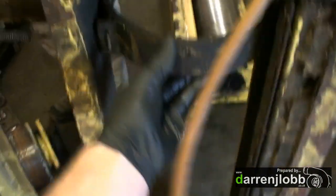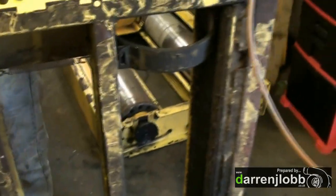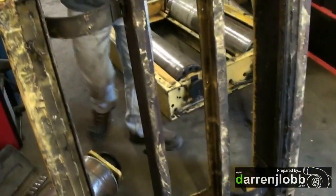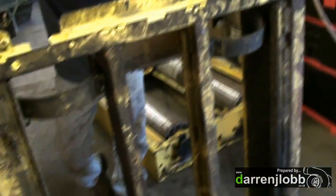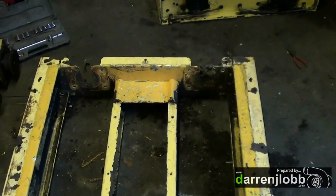These are the mechanical brakes — there are air valves on them. The idea is you push a lever and it locks the roller so you can drive the vehicle on and off the dyno; otherwise it would just spin the rollers. We just need to work out how to get them off. Frame number one — bit of a state, but you can tell this is old because everything is made properly.